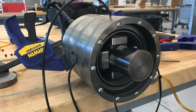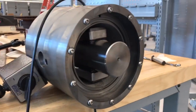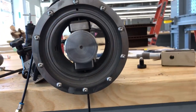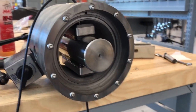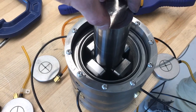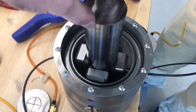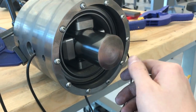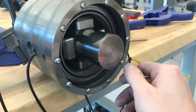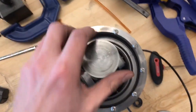Here it is all together — all 4 radial bearings in the housing with the shaft in it, mounted up and ready to go. Here we just have 2 of the bearings in there with the shaft mounted in, and the whole thing tilted so it's doing that self-propelling effect I talked about in the other video. With all 4 in there, this is demonstrating the gimbling ability of the bearings on their ball mounts. Not a whole lot of preload in this demo, but it really shows how the shaft is going to be able to align and find itself square with the thrust bearings on the housing. Here it is with a little bit of preload on it, just spinning it around — it's not behaving completely frictionlessly, but that's just because it's resting on something in the back to keep the shaft from falling out, which causes a little bit of friction.